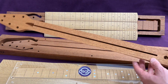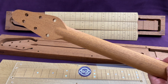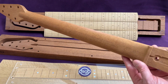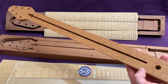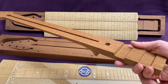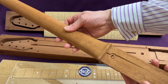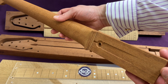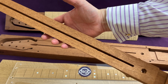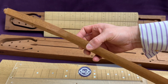Before I get into the work itself, I'll introduce you to the method by which I plan to assemble my new Red Special neck, which is unorthodox because I exploit CNC as much as possible to make both the mahogany part and the oak fretboard. The loose neck that I'm trying to recover to a usable standard is based on my second design iteration, and it's got pickup rebates which are too deep and a straight-sided volute region. The main section width hasn't quite cut as per design, but otherwise this is good quality, linear grained, genuine mahogany, free of unsightly figuring and again too good to discard.